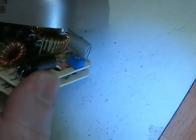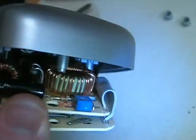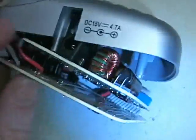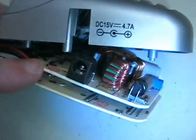I've prised the top board open. Here's the high-current switch mode supply — that's got to be supplying the four times eight amps minimum required for the batteries. And this is interesting: there's a little spring-type contact in here. When you push in this contact, it pushes down and actually enables that channel. That's actually quite neat — I really like that.